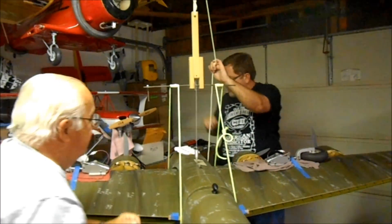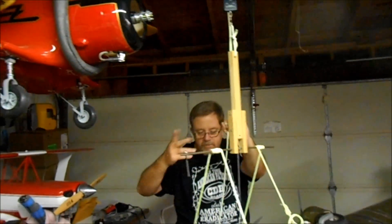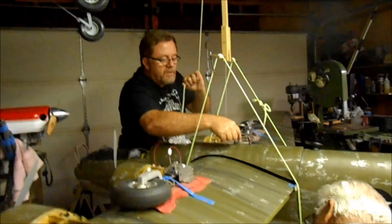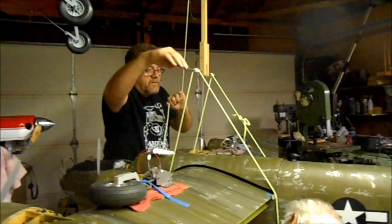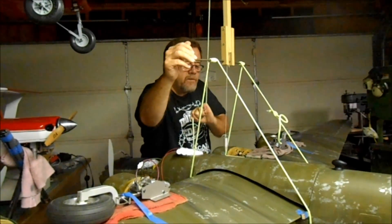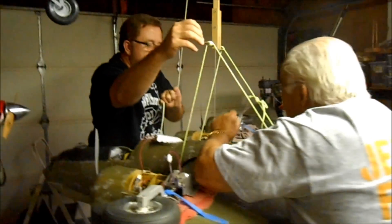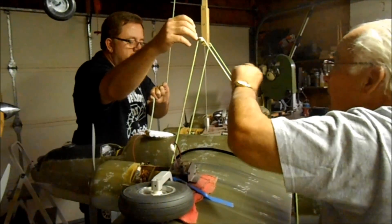We have added four pounds to the front gun turret area. We're about to do another pull — taking the weight up onto Vanessa right now. We look at the spirit level and rotate until all the weight is off the chocks. We rotate until we get a zero bubble. Frank, can you stabilize the plane? Grab that plumb bob and make it stop. Okay — we are at zero bubble and we're ahead of the CG. We are a little nose heavy.